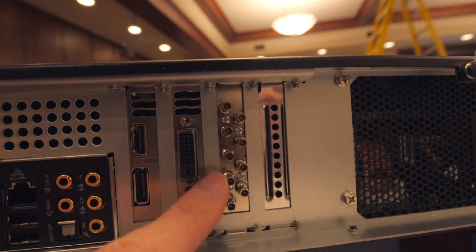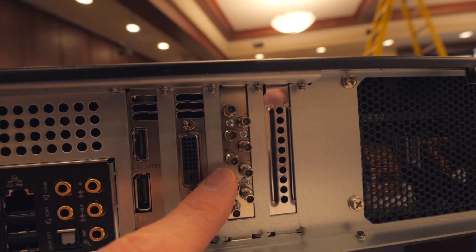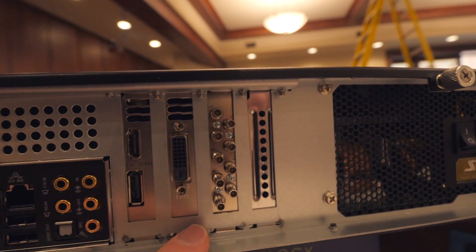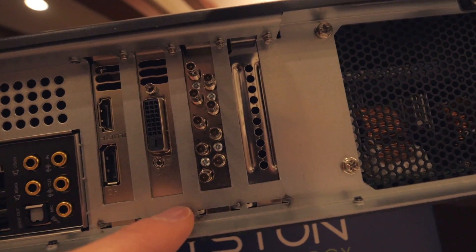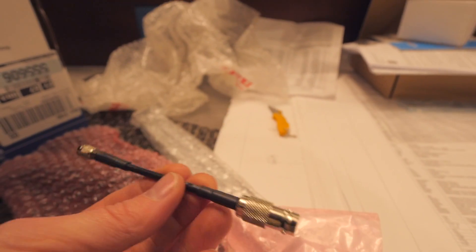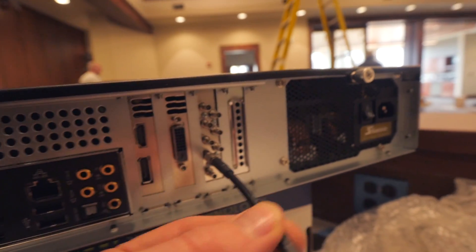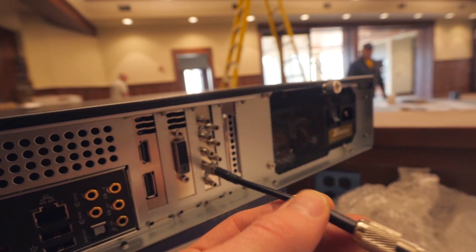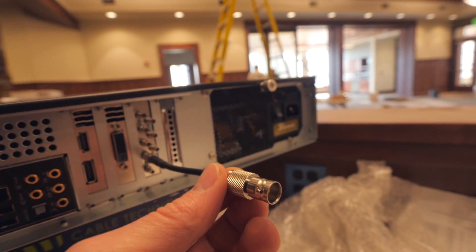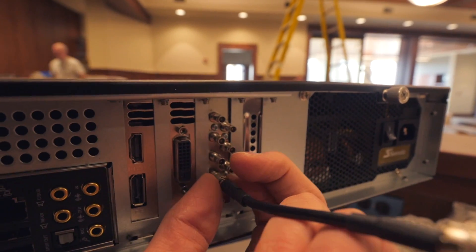To pack them all into one slot, they have these little mini DINs. We have these little adapter cables that go from this to the full size BNC. I really like the fact that they're labeled one through eight, which makes it really handy. Here's the cable — you can see how it works. It just literally plugs right on and locks in. You just connect your SDI cable right there, and to pull it off you have to grab the little collar and pop it.